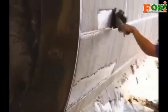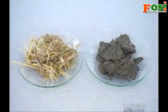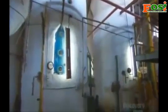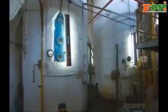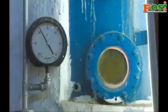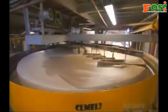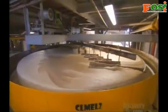Workers filter the residue, known as mud. There's no waste here — the mud will fertilize the cane fields, and the bagasse will be burned as fuel. The clarified juice collected from the clarifier tanks now boils in a series of evaporators, bringing the concentration of sugar in the juice up from 15% to 60%. Then the juice collects in 15-ton tanks to clarify even more.